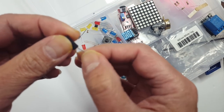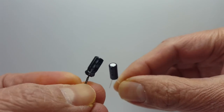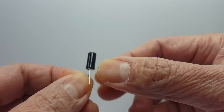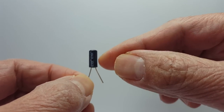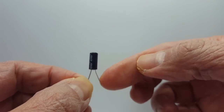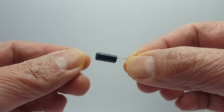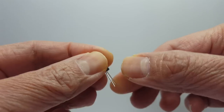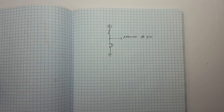We need some sort of input. Although the kit doesn't come with any accelerometer, it comes with this — it kind of looks like a capacitor, doesn't it? This is an electrolytic capacitor, and this is the tilt switch. I've never actually opened one, but according to the internet there is basically one or two balls inside, and when it's resting the ball closes the contact between the two leads. What's surprising is how sensitive this thing is, considering it's just mechanical — I almost think it was too sensitive for rolling dice.